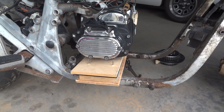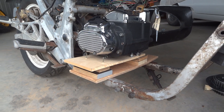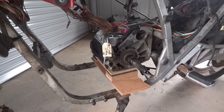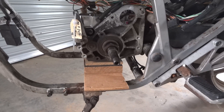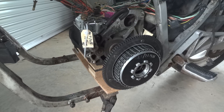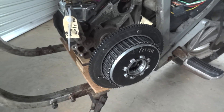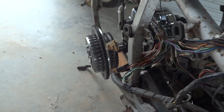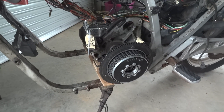Carrying on with the mock-up in a little more detail. Now that I know where the gearbox goes in the bike, I made a little wooden mount to sit it in the right place. Not very exciting from this side, but over here we can see where the input/output shaft sits in relation to the swing arm and the frame. That's pretty much where it's going to go. There's the clutch in place, bearing in mind that ring gear is going to disappear. It's going to stick out overly too far compared to where your foot goes on the peg.